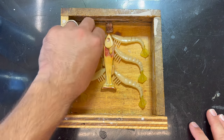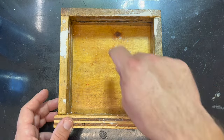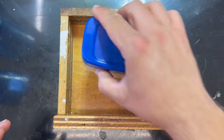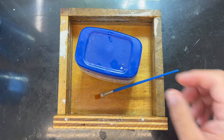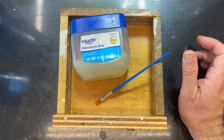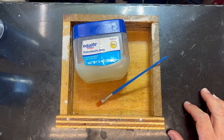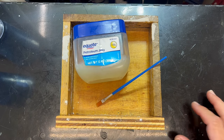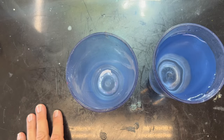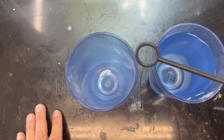We're going to take these parts and pieces off camera, and the regular assistant is going to slather this with petroleum jelly. It's going to be a DAP plaster of Paris two-part plaster injection mold. The method we're using today is grandpa's method - quick, dirty, and cheap. We have our cups of water, and today we have a new piece of technology in the shop.